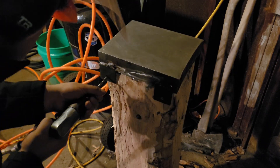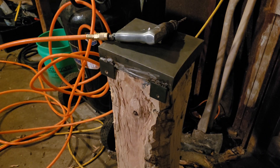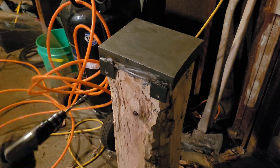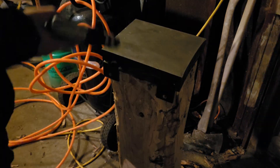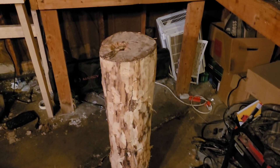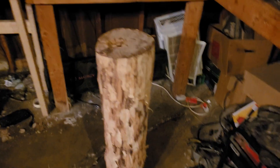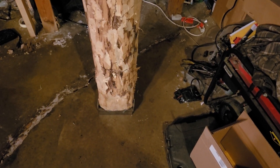Normally through this point in the process, I would explain that you have to drill a hole before adding your screw or bolt to prevent cracking inside of the wood. However, while I was doing that, two of the four screws I decided to use snapped. I didn't want to include all that failure in the video, mostly to save myself some embarrassment and to not waste your time. I'll leave it like this — the caulk still needs to dry and the weight of the log should keep it compressed enough so it solidifies completely. I'll figure something out with those bolts later.